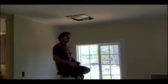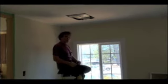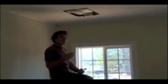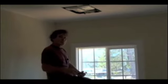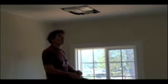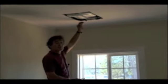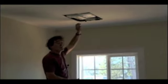Because the house is so airtight, it has a breathing problem. If you don't open doors and windows, the air doesn't exchange, or at such a low rate. You need to introduce something that exchanges the air if the doors and windows are not open or not used. So thus enter the ERV, called Energy Recovery Ventilator.